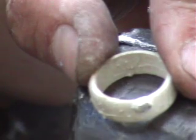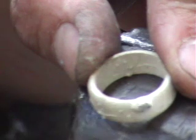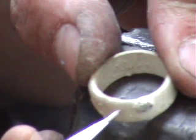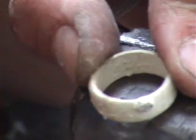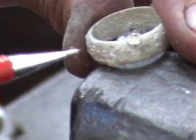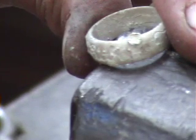Here's my ring, and if you look, there's the remnant from my sprue button — that's the first thing I'm going to address. While I have my ring off, I'm also going to inspect it and look for any imperfections from the casting process or air bubbles. You can see a couple tiny little points here which are air bubbles or remnants of them. Those are going to take extra care, and hopefully they're not going to obscure the design. Here's an example of the other ring with the sprue button, and you can see a couple small imperfections on the casting.